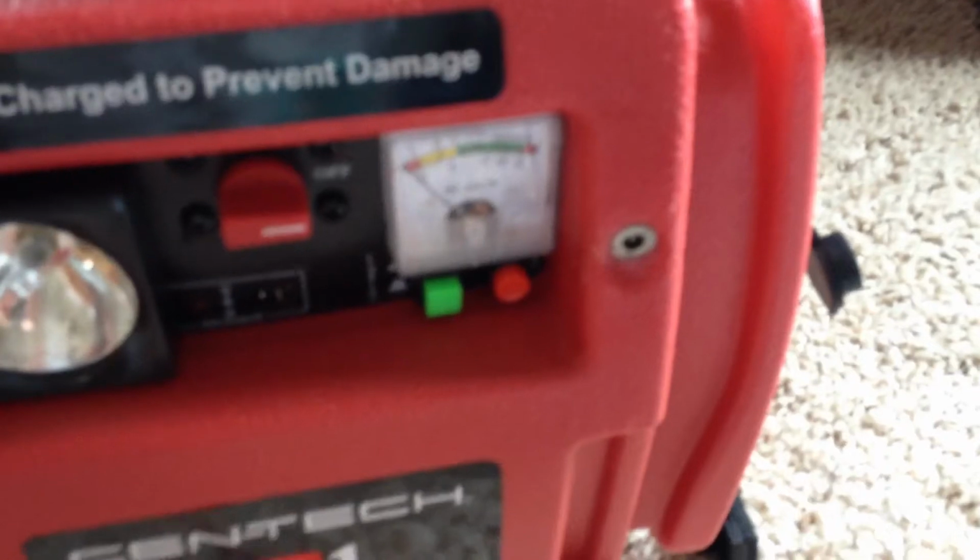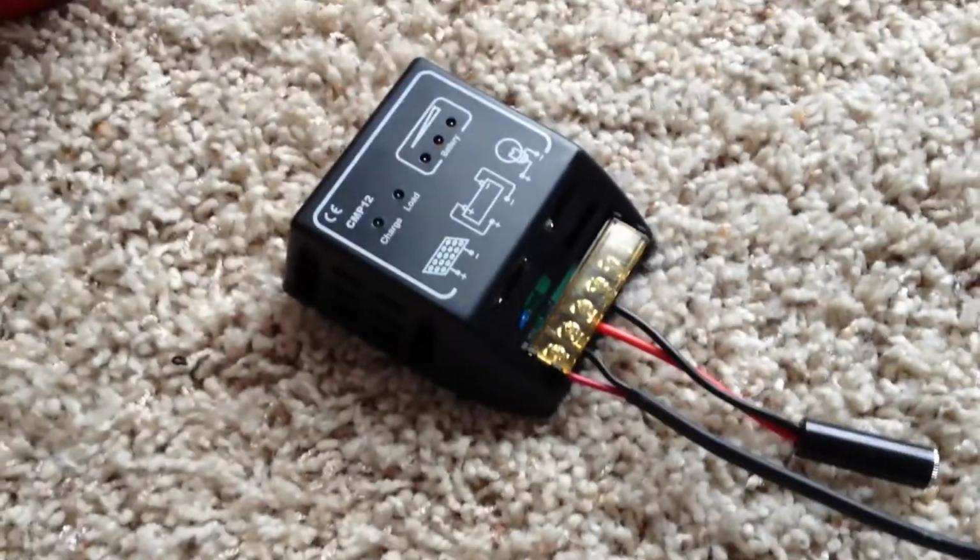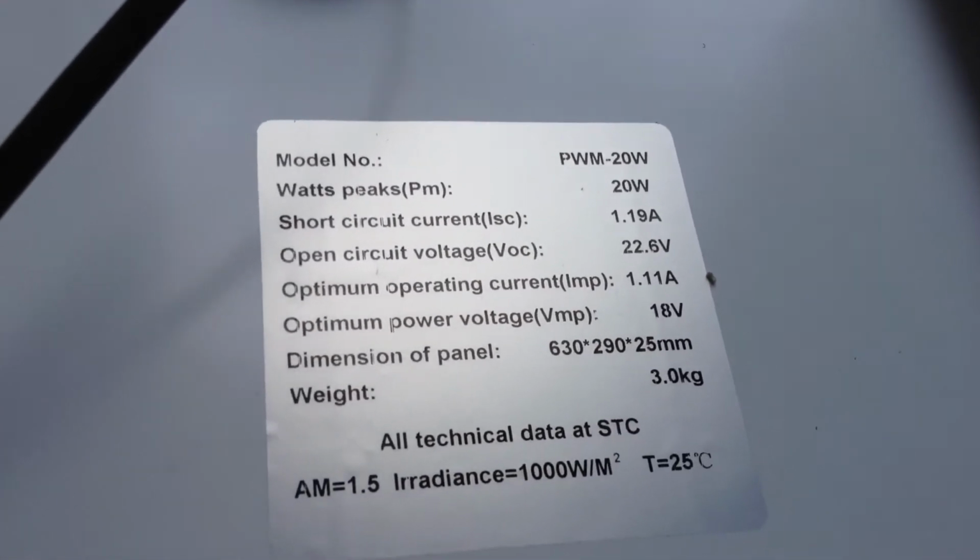But if you're going to be adding more panels, you're going to be adding more amps. So it's important that you have the right gauge wire. If you're going long distances, you're best off to have as short of wires as possible, especially when you're using larger solar panels. If you're running 50 feet of this small gauge cord to a solar panel, you're going to melt the wires and you could cause a fire, and it's just very dangerous. So try to stay as close as you can to plug into your power packs. With this we're 1 amp, so we're fine. We could go even longer than 18 feet as I showed you on the charts, but just read about your wire size. I'm just giving you basic information that you need to know.